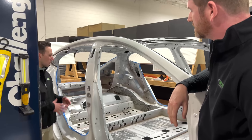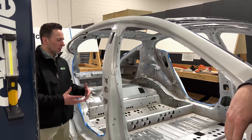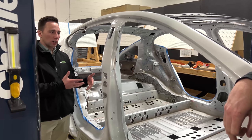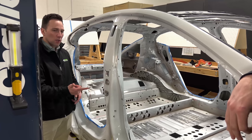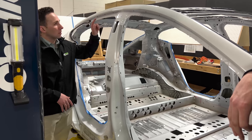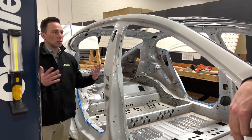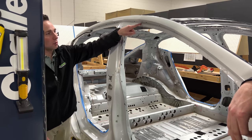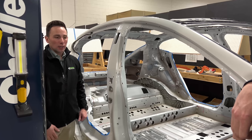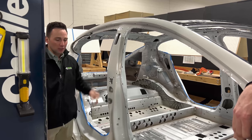As a general note, looking at all the stuff in this car, there's clearly a lot of engineering in terms of the structure — all the castings, extrusions, stampings, self-piercing rivets, die castings. These are all big-boy OEM things; we're not looking at startup elements anymore. But this is the finesse you get from being an OEM that's been around for 30 years. These are some telltale signs in a Body in White that the process isn't fully dialed in yet and they're having some quality control issues. It's typically an area we're always attracted to when we look at a new Body in White.